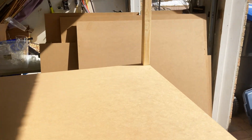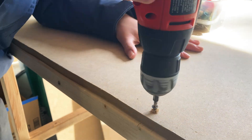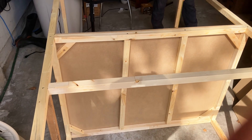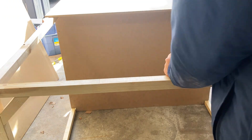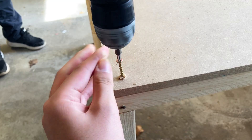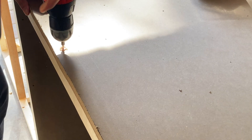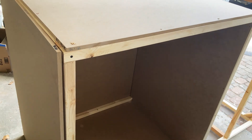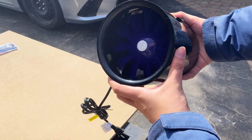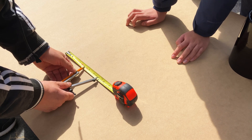I can then place this huge board on top and get to screwing the sides. The first board that I attached was the bottom surface, or the workspace. Since I had 1.5 inch square beams on each of the four corners, these were drawn and cut out. When this was all done, we got to fixing on the backboard, again by trimming it a bit, turning it around and placing it on. Four of the sides were done, and now I just have to use a compass and draw a nice round hole slightly towards the back of the top board with a 6 inch diameter for my ventilation tubing adapter. I knew geometry and math class was going to be useful someday.